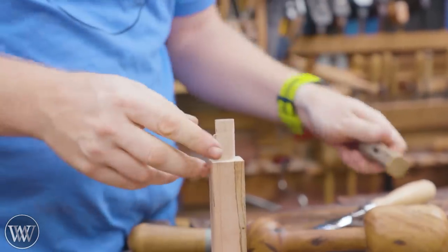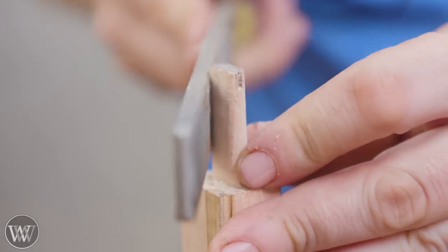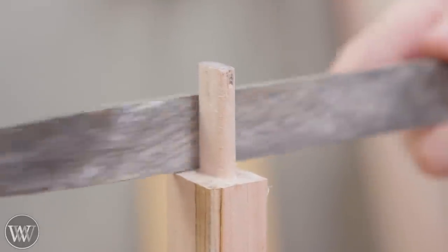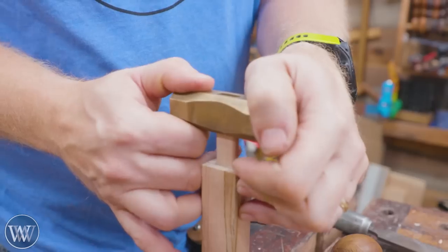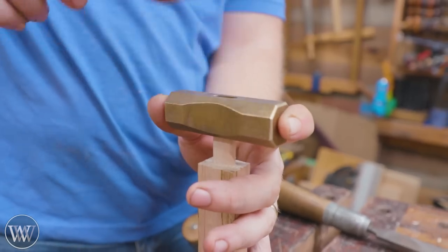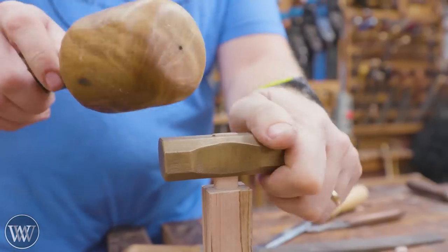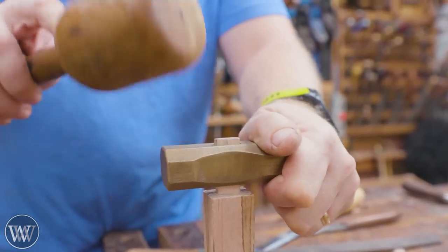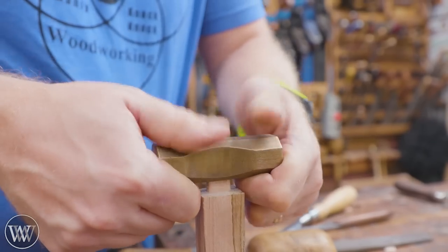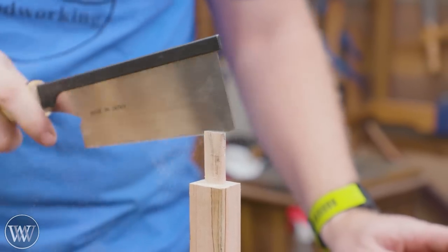These heads are actually tapered so that the bottom side is slightly smaller - you can see where it's run down to. From that point on, you never touch anything above where it has run down to; you just touch the areas below where it's at. Every time you put it back on, it goes down a little bit farther, and you keep going until you get it all the way down. You only want to drive it all the way down on the last time when you actually hang it.